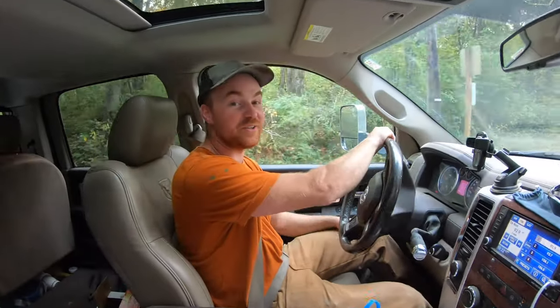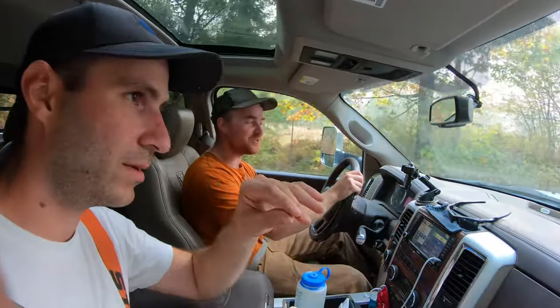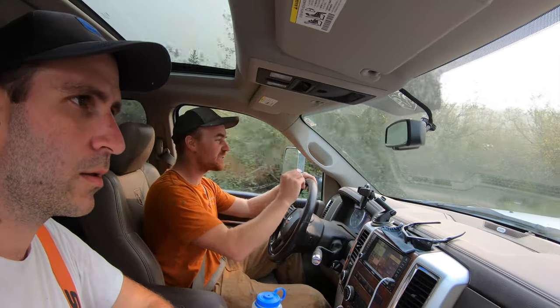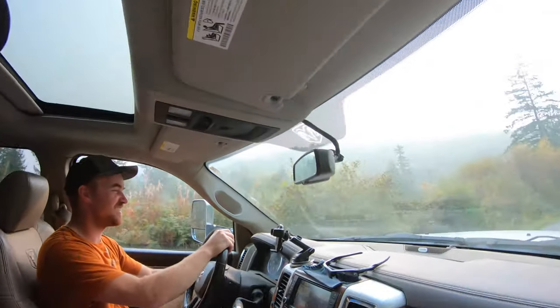Go get a power trowel, get the nice smooth finish. The power trowel like burns the sand essentially, kind of, right? Like, yeah, steel. Glassy. Steel troweling makes basically a thin layer of glass on top of the slab, and that's what gives it that nice shine. Getting glassy. Yeah. All right.